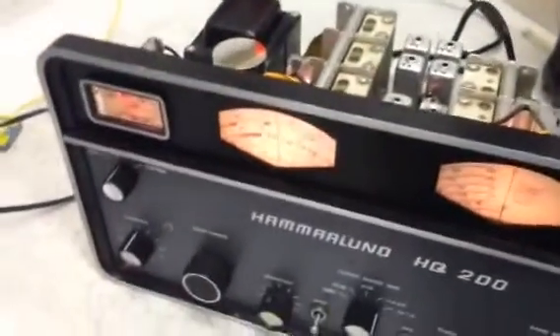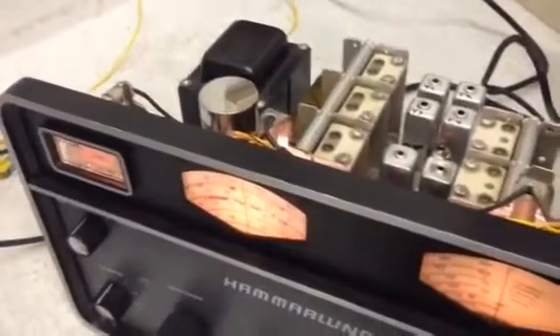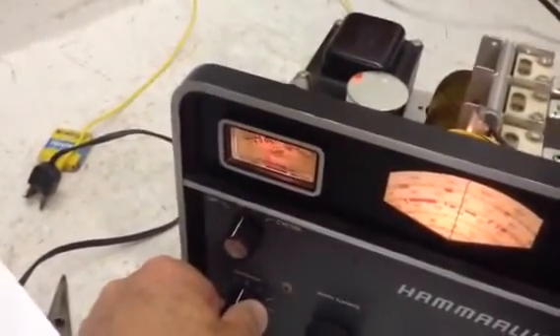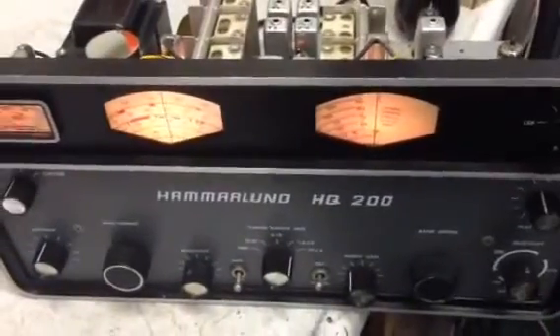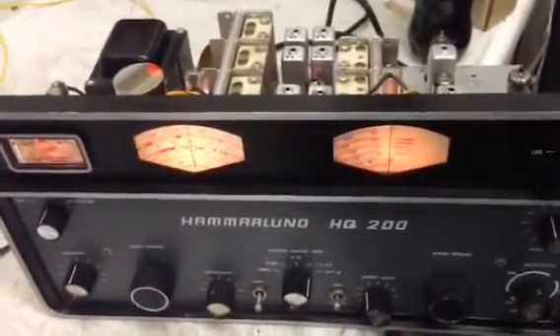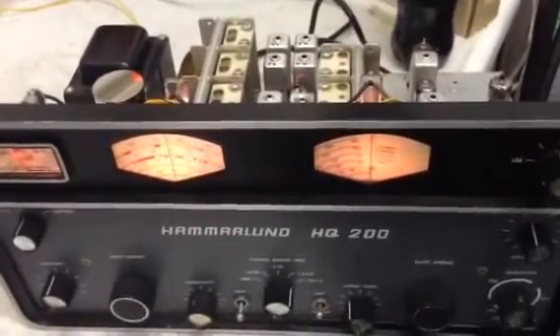All the noises from the fluorescent lights are just harsh — I just realized I could turn it off and make things a lot quieter. What we're listening to here is a pretty weak signal: 0.1 times 5 with modulation — that's on the broadcast band at one megahertz, peaks real good. All the other bands are basically the same, with the exception of the top band, which takes about two microvolts to get a decent signal on 26 MHz — so this isn't what I'd call a real performer on the top bands.